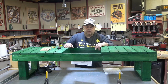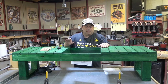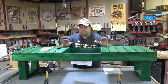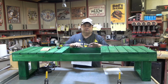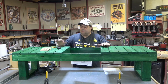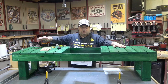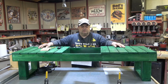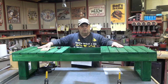The first thing you will need to do is to cut the materials according to the cut list. Make sure when you pick out your materials that the materials are not twisted or warped. Make sure your 2x4s are not twisted, that they're straight. This will ensure that your project gets put together square and level, and when you take this out to your apiary or in your backyard to set it up, that it's easier for you to level it off.